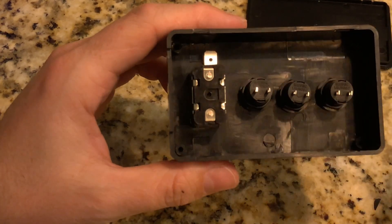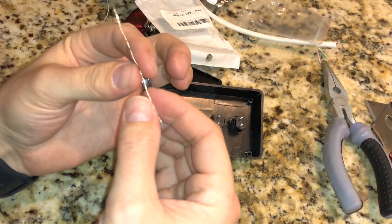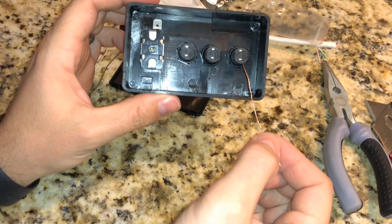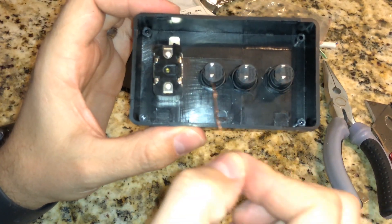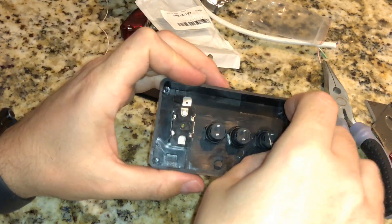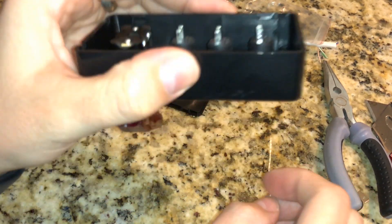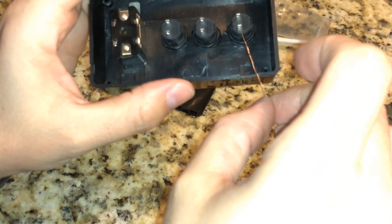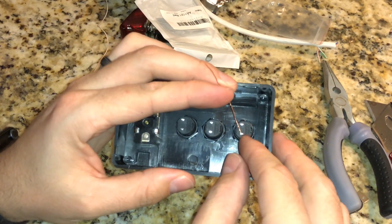What I'm going to do is take a ground wire and make a jumper so I ground all the switches at once. I took a piece of Cat5 cable — or similar wire you have laying around. Try to get a thin wire because it makes everything easier. For the breakout box there's no real power involved, it's more just a signal being sent through the wires, so you don't need anything huge.